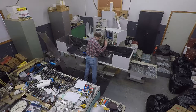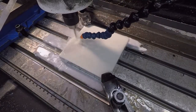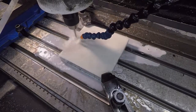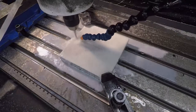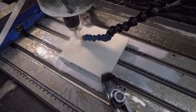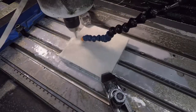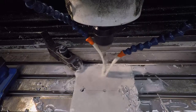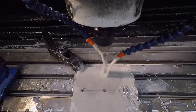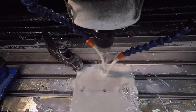The first tool, a drill, was mounted in the mill. A hole near the outer rim of the adapter was cut and will be threaded later. A socket head cap screw will be fastened and used as an index locator in the Mitchell plate. The next tool, a larger drill, was then mounted. This tool cut the four mounting holes as well as a pilot hole for the center clamp bolt.